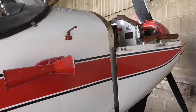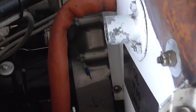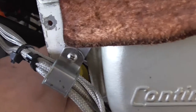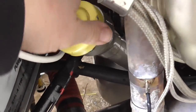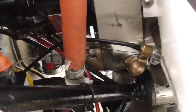As long as you just get it balanced properly, it's really held in place with two pegs. Checking the mechanical fuel pump and the leads, we go around and check fixings on the various plugs and round into the back, having a look to see that all connections are made as they should be. And then in here for an oil check — that's reading four, so that's fine. Put that one back in, tighten it up, and while we're in there, just check that everything is in place and locked.